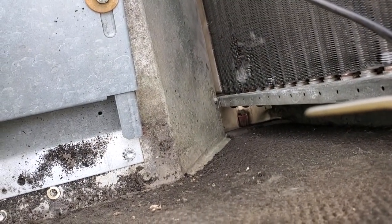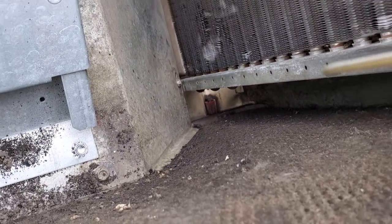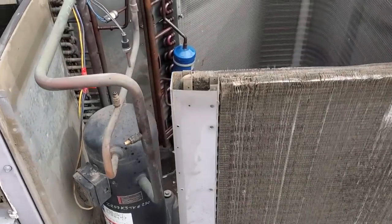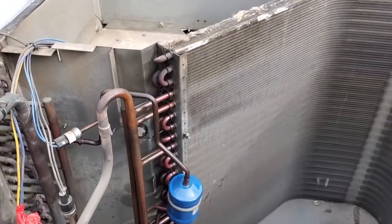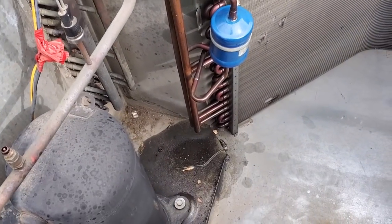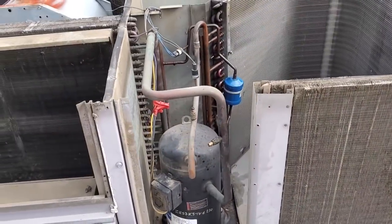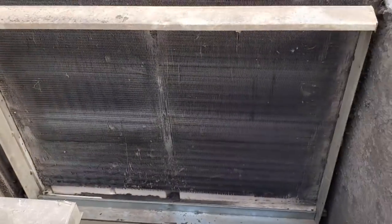There's a wire nut in that drain — that's a head scratcher because you'll be blowing it out thinking it's draining fine. This unit still has positive pressure. I'm going to go ahead and clean this condenser and clean off all this oil first so we have a clean slate and the leak detector's not going crazy. We're going to split the condenser and clean it, then do a leak check after that. And since we've got the top off, we'll rinse the evaporator and clear that wire nut out of the drain pan too.